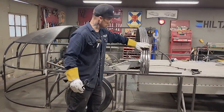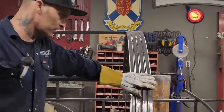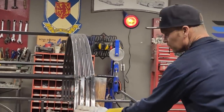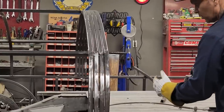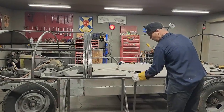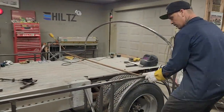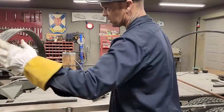As you can see, we have three more roof rafters made, I'm gonna call them, because I don't know what else to call them, roof rafters. We made them according to this one. What's gonna happen is they're all gonna be pulled off just like when me and Jolene made them last time. We'll put them on every 2 foot center. So we got one marked off here, we got one marked off here, and then we have one marked off here. So in actual fact, this is what it's gonna be.